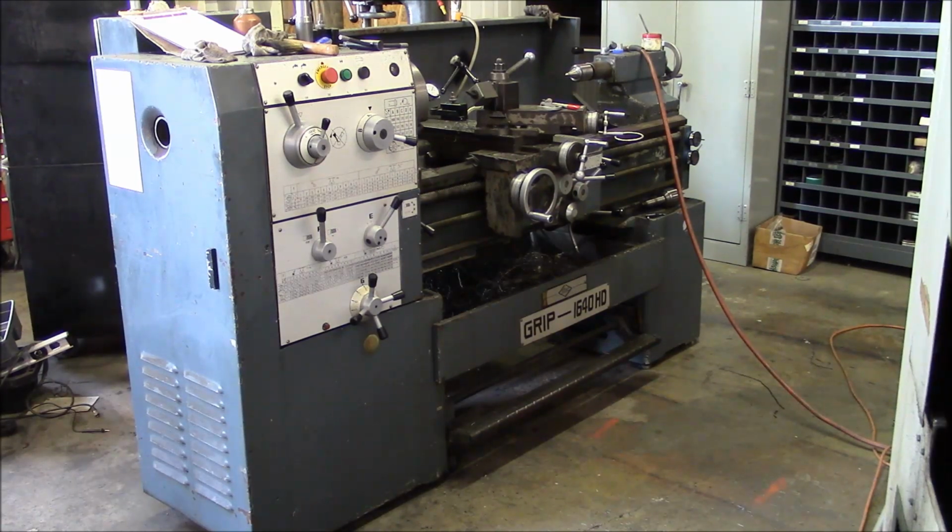So then, as far as the next step for this machine, we still need to definitely address the wear in the cross slide. That's a big issue. And I need to make a sled to check the alignment of the bedways. So that'll probably be the next video. I've already started it. I just need to finish it up. And then we'll get started on re-scraping the cross slide and possibly scraping the bedways. And then I want to pull the apron apart and check that power feed clutch. Something's wrong there.